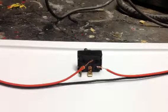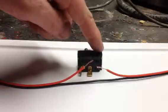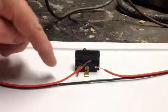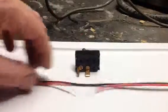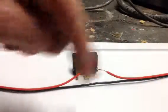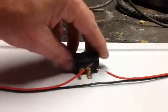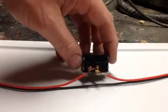is, in AC wiring, a lot of times past this switch, you may have other outlets or other switches, and if you switched the ground, when you turn this switch off, you now just removed your redundant ground from all of your outlets. So it's not a safe practice. So it's just a good idea to always have your switch switching the positive.